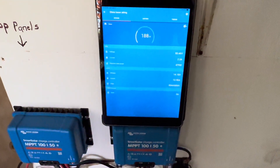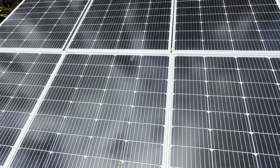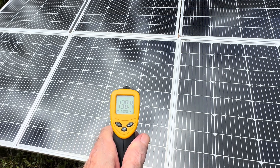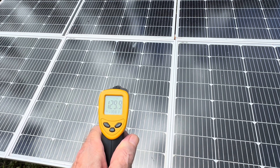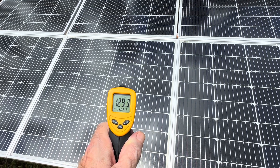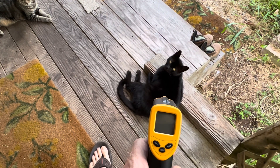A lot of you have asked about the temperature on these things — you've noticed they're warm to the touch, sometimes quite warm, but that's how they're intended to work. Now we're looking at that 700 watt string. Let's see how hot those panels are: full sun, 130 degrees. It's because of that temperature that we're not pulling the full 700 watts — it was around 630 or so. They're pretty hot, and that's why. If it was cooler, the wattage would go right up closer to 700. As the panels get hot, they decrease some of their output — absolutely normal.